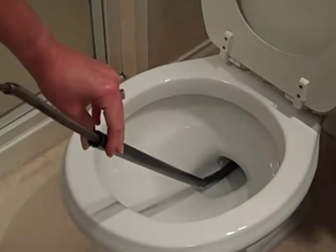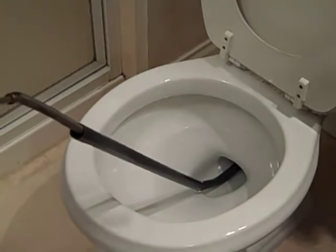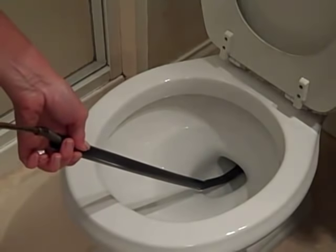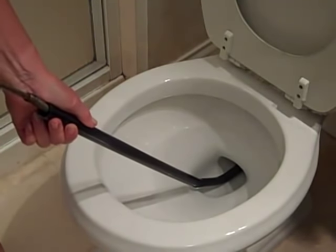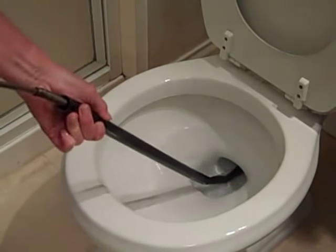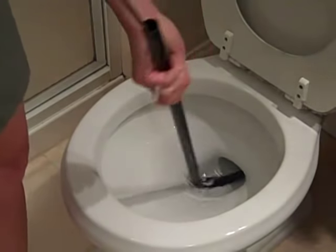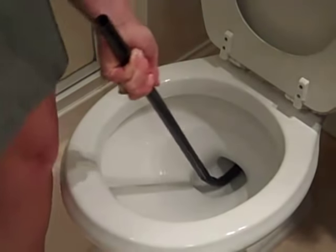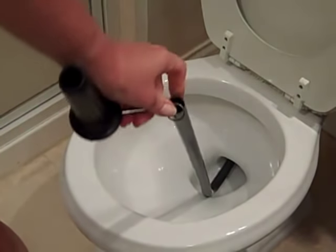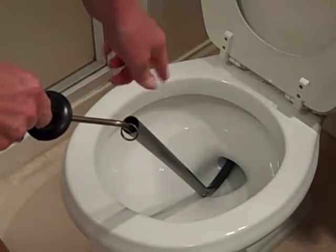Now, the hardest part is pushing this coil all the way down to the handle. The handle ends up here on top of the plastic, through that whole part of the toilet that swirls up and down and around. It takes some practice. If you're learning how to do this for the first time, you might want to practice on a toilet that's working fine, just before you have an emergency — especially if you have a one-bathroom home or apartment. Push — you can see it even takes me a little bit of time to get going. Finally, I get it all the way down to where the handle is at the top, the bent part. That means the snake has gone all the way through the toilet as far as it can go.